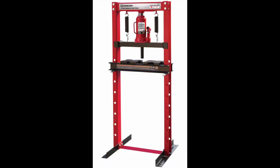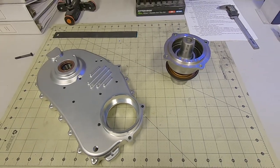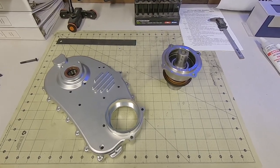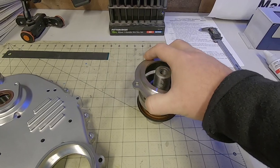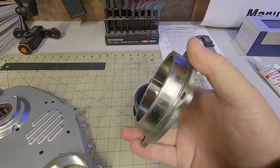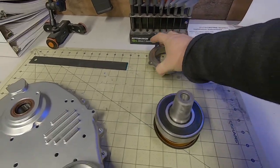After that I had to phone in a favor from a friend that had a hydraulic shop press that I could use. I didn't film while I was over there, but it looks something like what you're seeing on the screen now. The goal is to remove the shaft and the bearing from the bearing retainer, being careful not to use too much force since you can only press on the center of the bearing. Applying some heat to the outside of the retainer should be used to minimize the force needed to free up that bearing.